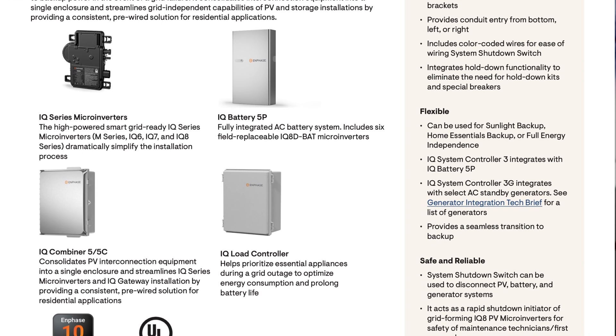The combiner box — if you have a current generation IQ 3 or IQ 4, you'd need to upgrade to the IQ 5, because Enphase has gone with a completely hardwired communication protocol. That means the Envoy is hardwired to the system controller, and both are wired to the batteries. This should hopefully mean it's more reliable, because something Enphase has experienced with their current generation is that the wireless communication protocol has some drawbacks — they've really gotten it dialed in over the last couple of years, but they've definitely struggled with it across different installers and applications.